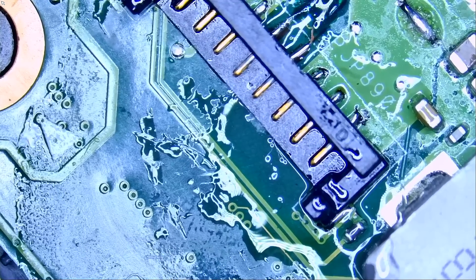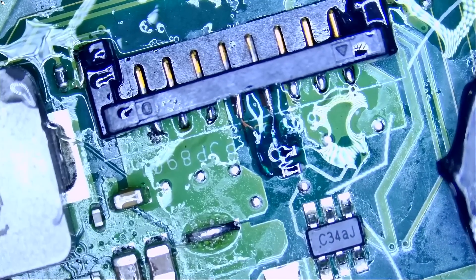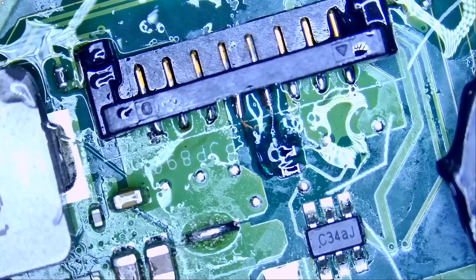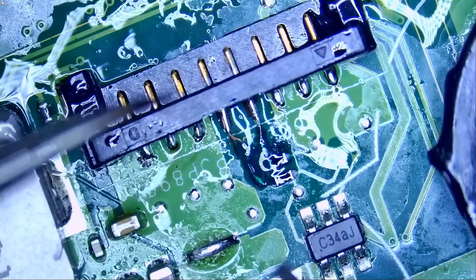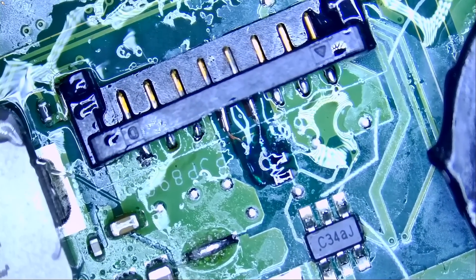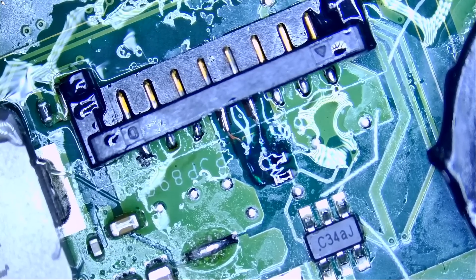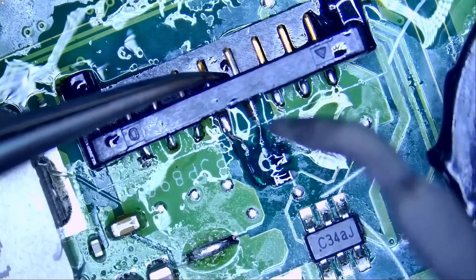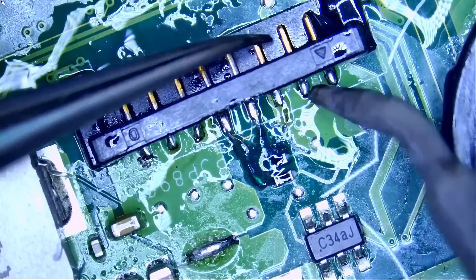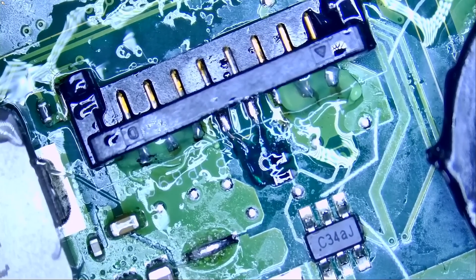We are solid left and right, but we're going to have to check on the pins to make sure they are all solid before I hand it over to Big Boss to reassemble and test. We still have to take care of the middle pins — I do not want to use a big tip on the middle pins, so we're going to use a tiny one. We do not want to disturb the pad strips. Solder mask is not glue — people confuse solder mask for glue. You can secure a lightweight pad strip with it, but the purpose of solder mask is not to glue things down.